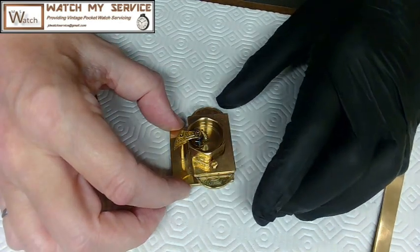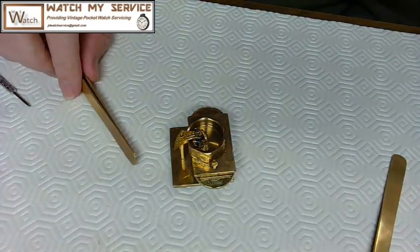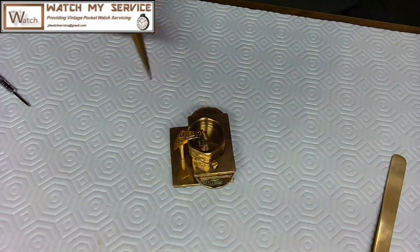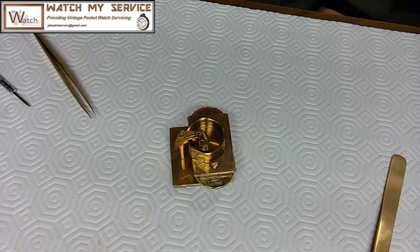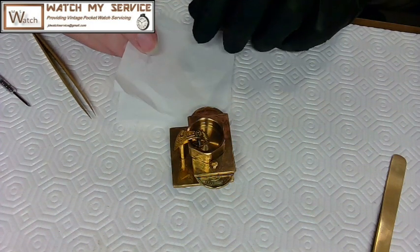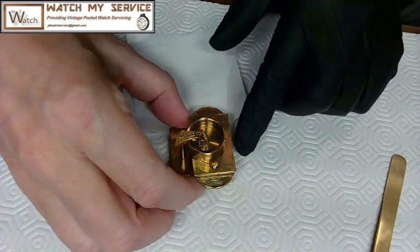All right, that is as high as I want to bring it. So that is drowning right now. The hairspring is drowning in there. So I'm going to leave that sit there. I'm going to put some watch paper underneath here, because I know that the lighter fluid in this dunker tank is going to come out because it's right at the edge.